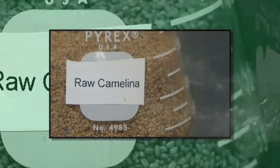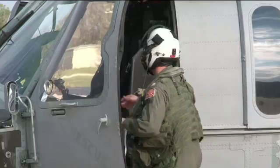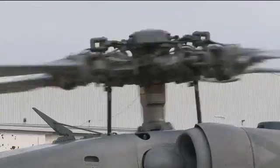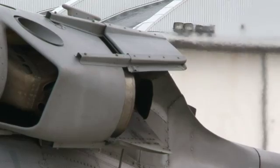It's actually a cleaner burning product. We're going to start off with a basic APU turn and let it run for a while to make sure the APU runs effectively without any problems. Then we're going to start up the engines, run up the rotors, let the engines run for a while and take in all the fuel. We're going to take some readings and make sure that the engines are running effectively.